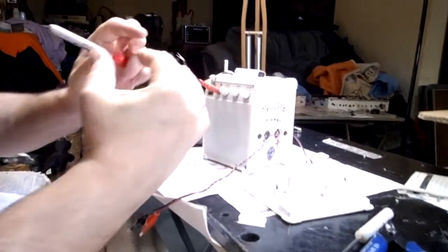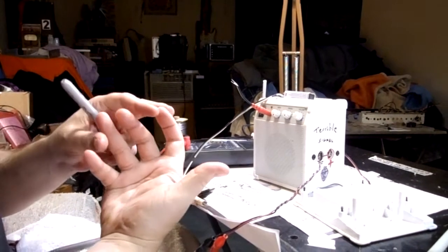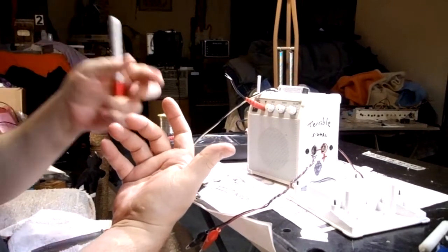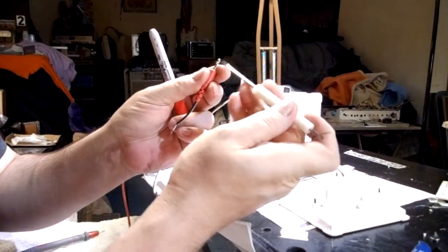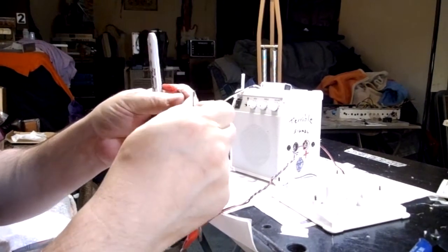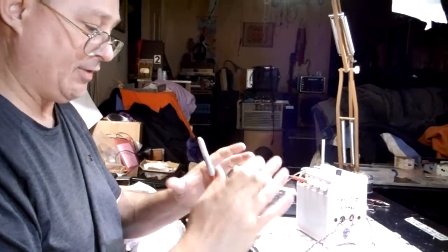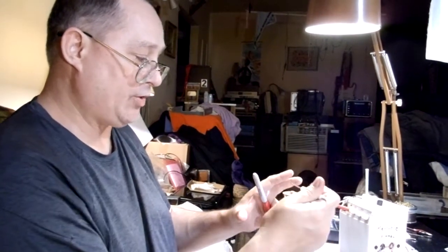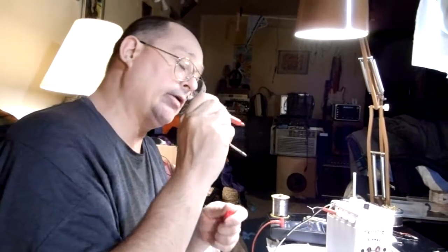Now typically when you're looking for the input on a jack, there's a jack that's soldered in, and there'll be two or three pins for that jack. So you just look right there and start there. And maybe you'll hit this one, which is at the front of the jack. That's going to be the ground. But the furthest point is going to be this tip connector here, and that's what we were looking for: the hot side, or the input. When I looked at the other side of the board where the solder points are, it would be the third one. So you have ground, right channel, and left is all the way in the back. Or is it left and right? I don't know. Point is, when we found it, we marked it with a Sharpie.